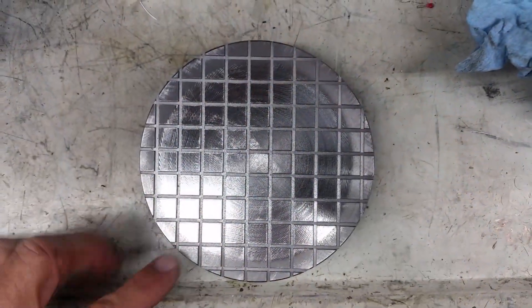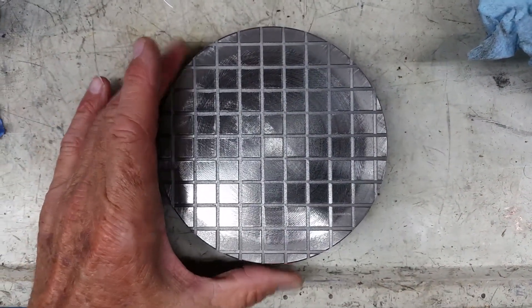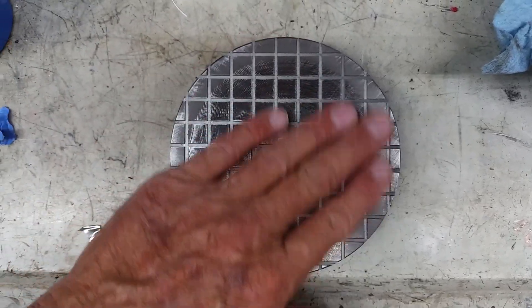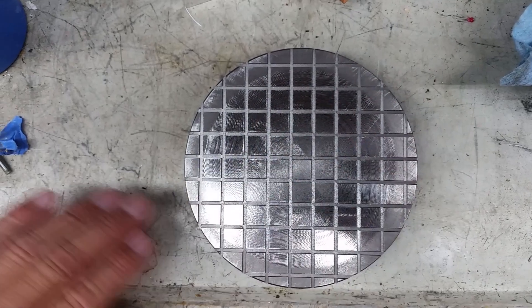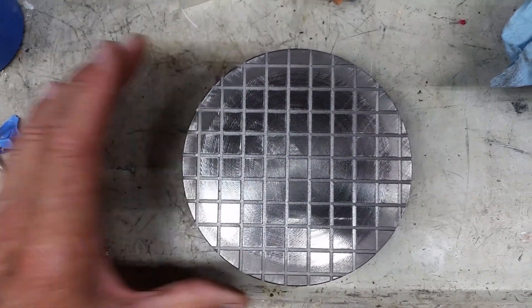This is what they look like once I've finished cutting the grooves. I went in here with the file and just took off a bunch of the burrs, so now the next step will be lapping them.